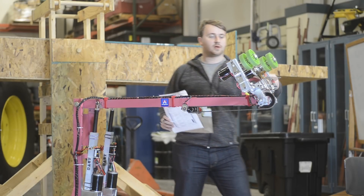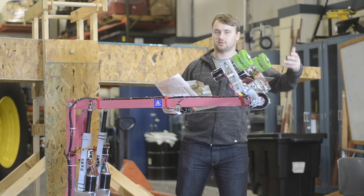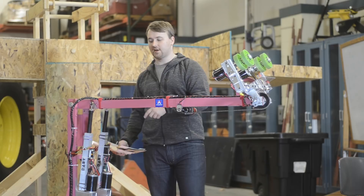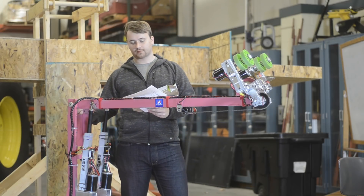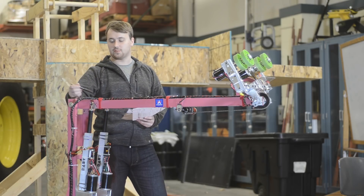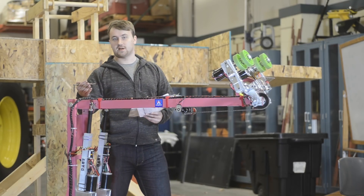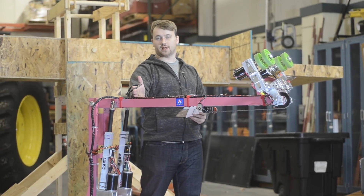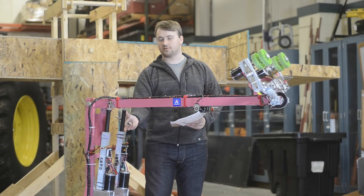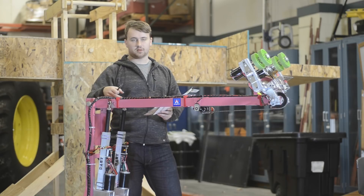This is about a 48-inch rod, and if the wrist is folded out, that adds another 11 inches beyond that with a lot of the weight being right out at the end. This worst-case scenario is about 270 pounds on these darts, and together they could produce over 400 pounds to support the rod. The axis point where the vector comes back up is about five and a half inches from the point of rotation. The reason the axle is this far down is because we only have 12 inches of stroke to work with, so to angle all the way from the ground up to about seven feet we needed it this far back.